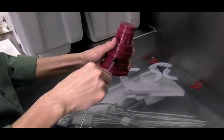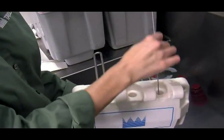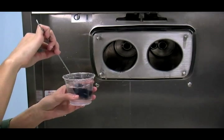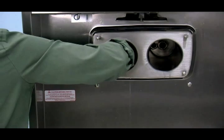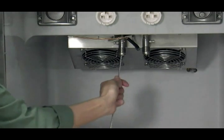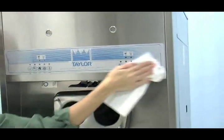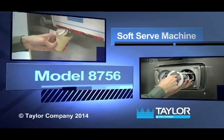Brush clean all disassembled parts in the cleaning solution, making sure all lubricant and mix film is removed. Take particular care to brush clean the draw valve cores in the freezer door. Place all the cleaned parts on a clean, dry surface to air dry overnight. Return to the freezer with a small amount of cleaning solution. With the black bristle brush, brush clean the rear shell bearings at the back of the freezing cylinders. Using the long, flexible brush and the cleaning solution, clean the mix inlet tubes located in the mix cabinet, thoroughly cleaning the tubes all the way up to the freezing cylinder. This area needs special attention because bacteria and milk stone can build up here. Wipe clean all exterior surfaces of the freezer and the mix cabinet. This completes procedures for assembly, disassembly, and maintenance for the model 8756 machine with a coaxial pump. We at Taylor Company thank you for watching this video.